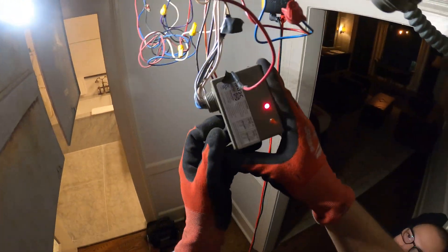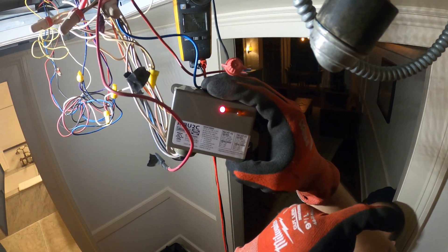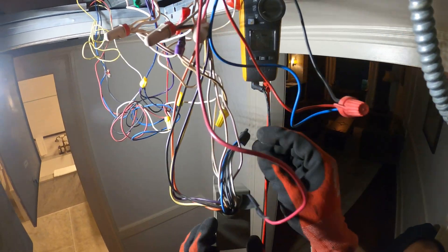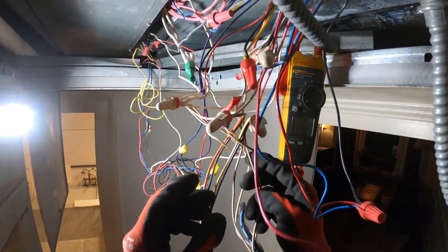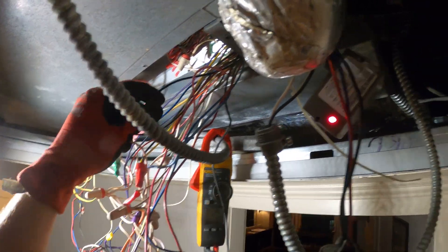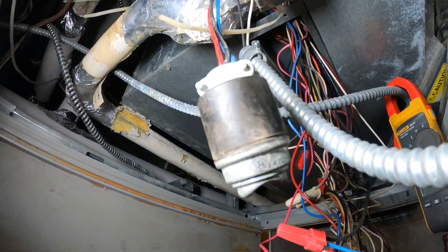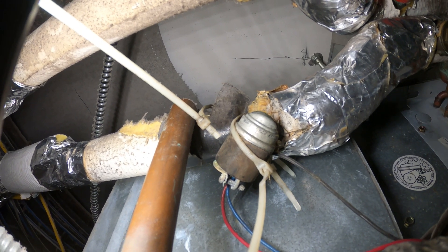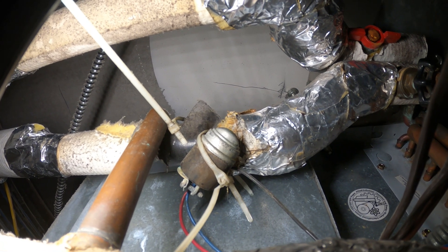What I want to do is follow the circuit — the coil — because that's being energized through the thermostat. Over here it says common is white and purple, and 120 volt is white and red. White and purple goes to the neutrals. Got a black one coming into this. So this one's sitting on the drain line too — they just wrapped it around the pipe. It's not sensing anything. Unbelievable.